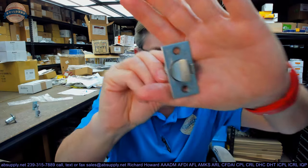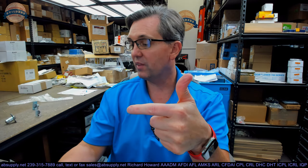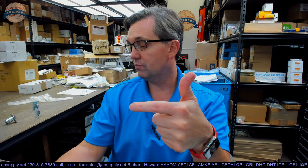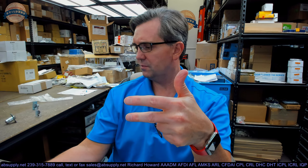This is shown in the 626 finish — that's probably just stainless steel. It's important to note the information stamped on that latch bolt: it has the UL and UL10C stamp, probably the listing number — a four-character alphanumeric value. It says 'listed single point lock or latch,' and it has the manufacturer's name on it.